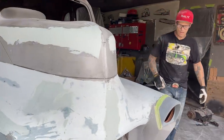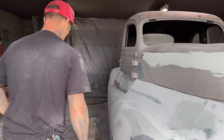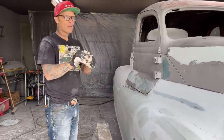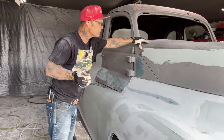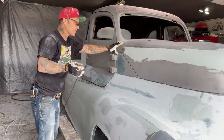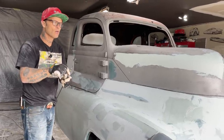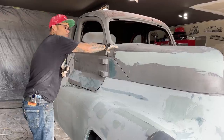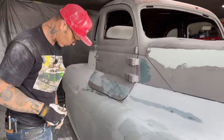I think that's fine. I think what I'm going to do is pull the hood forward. I'm going to apply the ramrod to the edge of the cowl and just tack it on. Then I'll push my hood on for the best fitment and then weld the ramrod to the hood, and then I'll release it as I've tacked it onto the cowl. That's what I'm going to do.